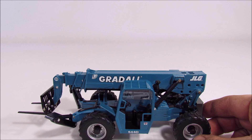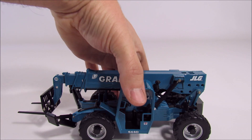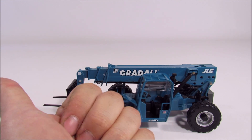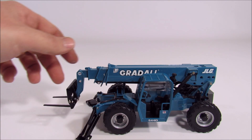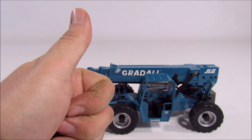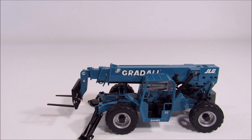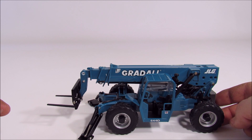The model number is 544-D10-55. What that means: the 44 means once you put your outriggers down, you can work out 44 feet. The 10 means it'll pick up 10,000 pounds. And 55 means your maximum working height is 55 feet. It's not a random model number — the model number basically tells you right off the bat what the capabilities of the machine are.